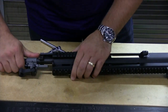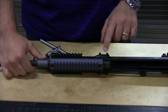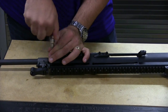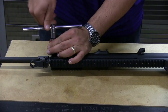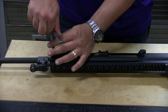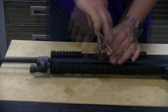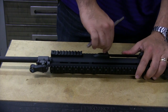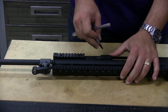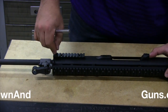Once you get this back in place, you're going to slide that back in until it mates up with these bolts. You'll actually have to push down on these a little bit to overcome the spring tension. You'll feel them grab and you'll hear that clicking noise, which is the detented bolts in the front. You'll do all six of these — you're going to want to screw them down until they bottom out. Once all those are properly torqued back down, we know they've bottomed back out, which is where they need to be.